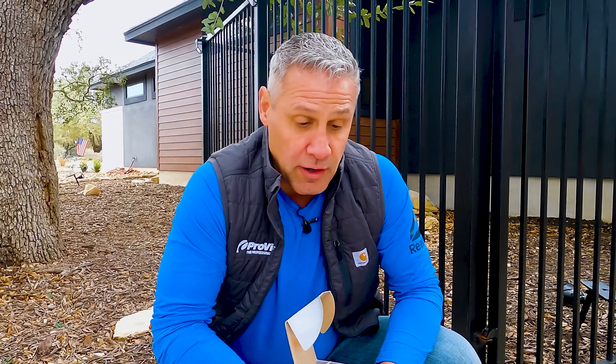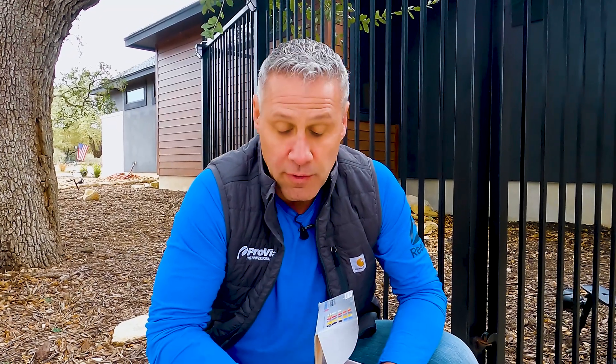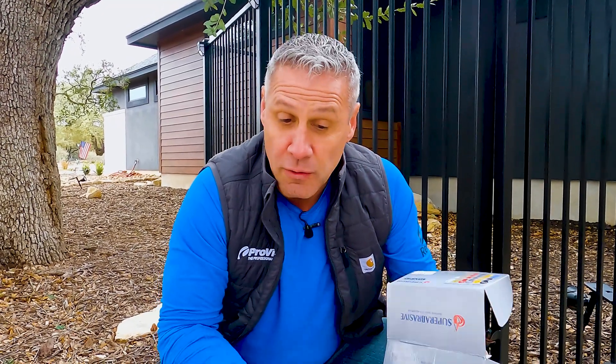So those are just a few of the tests. You'll see these tools when our design consultants come out — they'll check the moisture content, which can change, so we also do that on the day of installation. They'll also do a scratch test to see how hard the concrete is, so we make sure we're prepared and do the job properly so that it's going to last, we can warranty it for you, and you're going to enjoy it for years to come.